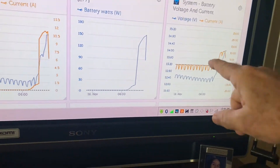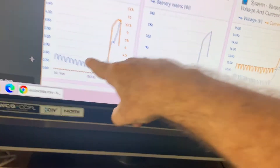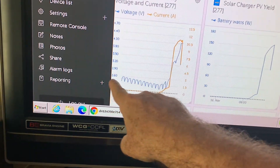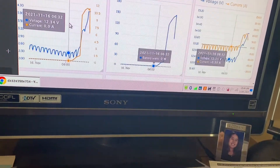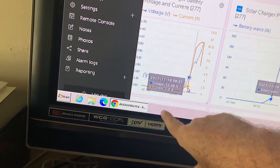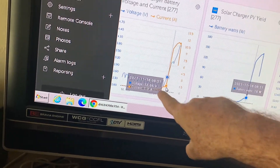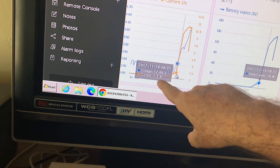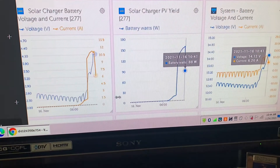Over the last 12 hours, here's where we were: there was no solar coming in overnight, so the batteries were just diminishing. Then we can see when the sun came up this morning — just hover over it. Right now we can see that at 8:51 AM it began to charge: 12.66 volts were coming in, 1.3 amps. As I scroll over it, it gives me a different view on those data points.